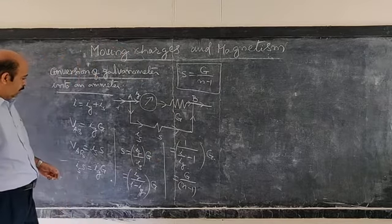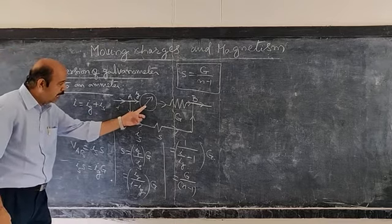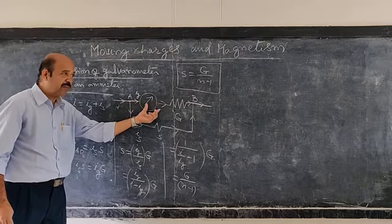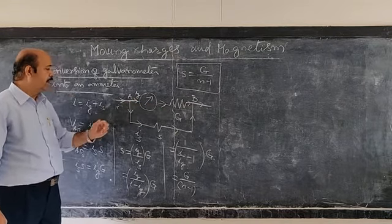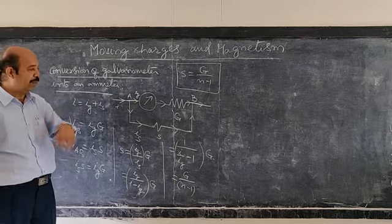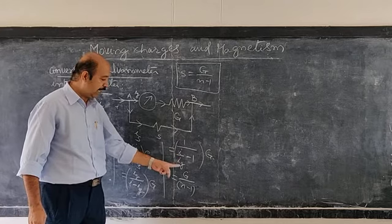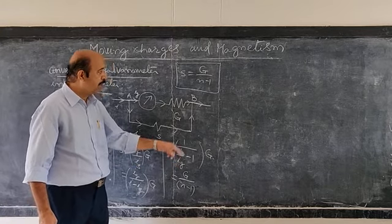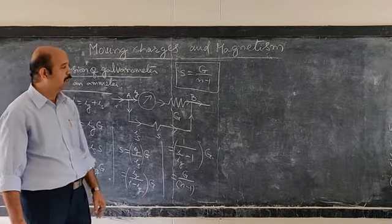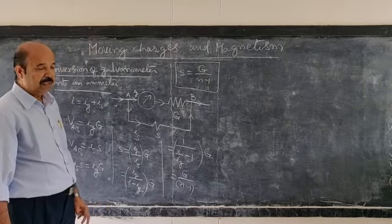So if you know the main current that you are supposed to measure and the current that the galvanometer can be used to measure. So if Ig is the current that can be measured with the galvanometer of resistance G, and if I is the current that you are supposed to measure converting the galvanometer into ammeter, then if you know that ratio, that is I by Ig, and you know the galvanometer resistance, then use this formula to calculate shunt resistance. So in this way, a galvanometer can be converted into ammeter for measuring large currents.